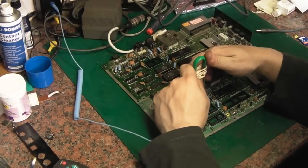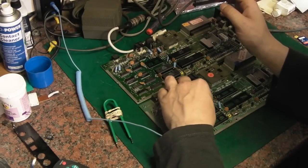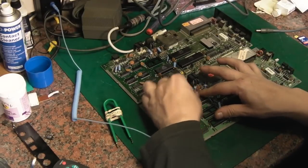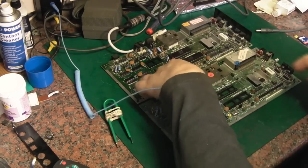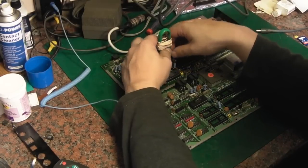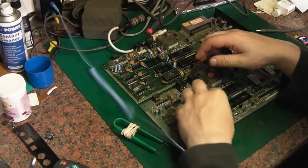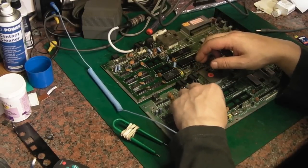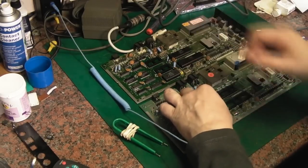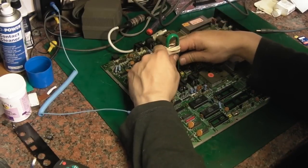So let's get everything transferred over onto this board. I'm not so much mindful about doing this now, especially considering I've checked. I know I've no nasty voltages. I know this one's got the original 7805 on it, but it's been tested. It's only giving out 5 volts. And I couldn't find anything nasty anywhere on the CPU or the TED sockets when I did have a test around. Obviously we still have to be mindful of anti-static, because that's what's going to kill these ICs now, if we're careless with them, and we don't want to be careless with them. We really don't.